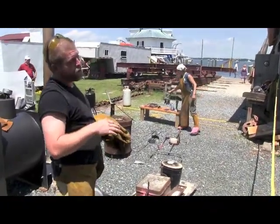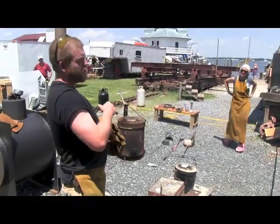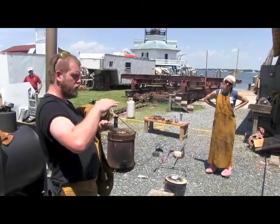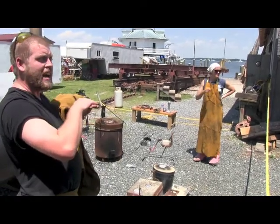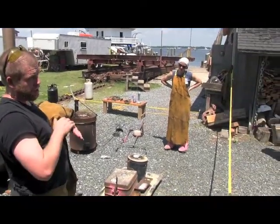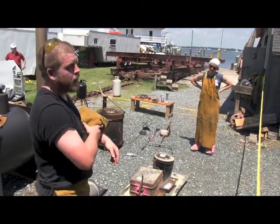The wet newspaper you put in between the crucible and the pedestal that it stands on every time. The furnace gets hot enough that everything gets soft in there. And if you don't put that newspaper in there, the crucible and the bottom of the furnace can stick together. They can get tacky, gooey, like liquid glass, and bond together. What the newspaper does is it sits in between the two where no oxygen can get to it. So it burns and turns to straight charcoal and creates a little release, so it always pops free.